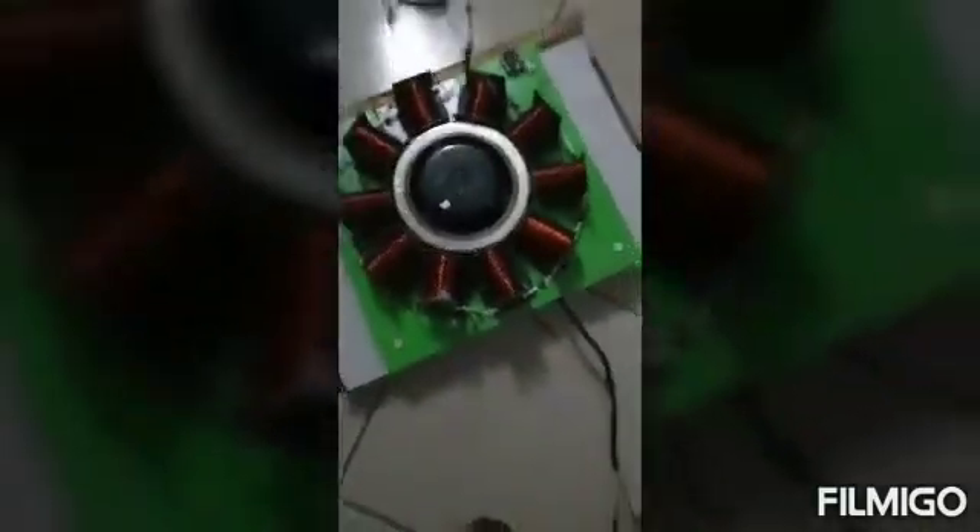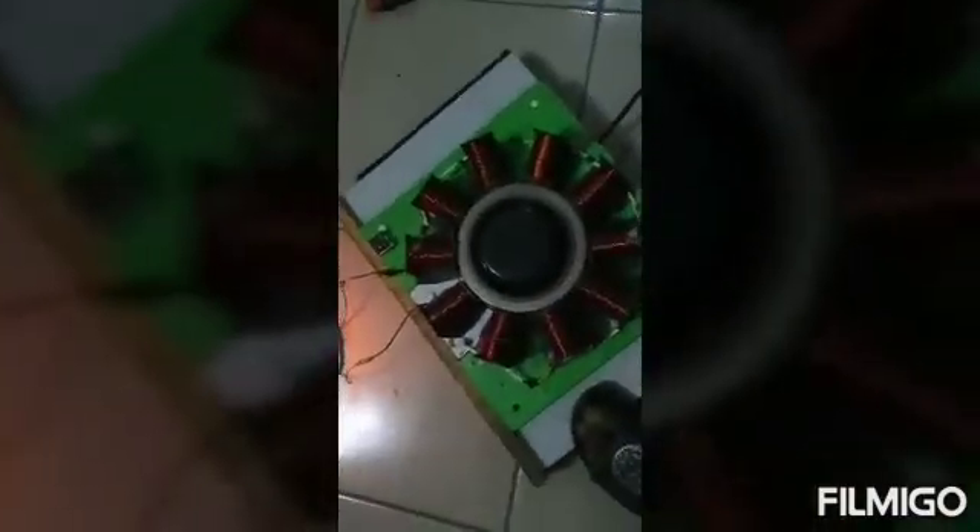So I just connected a 60-watt incandescent lamp. Let's turn it on and see the output — whether it can carry that 60 watts, around 150 watts input. Let's see if it can carry. It's glowing! It carries it. That's 60 watts. So we are going to increase it to 120 watts.